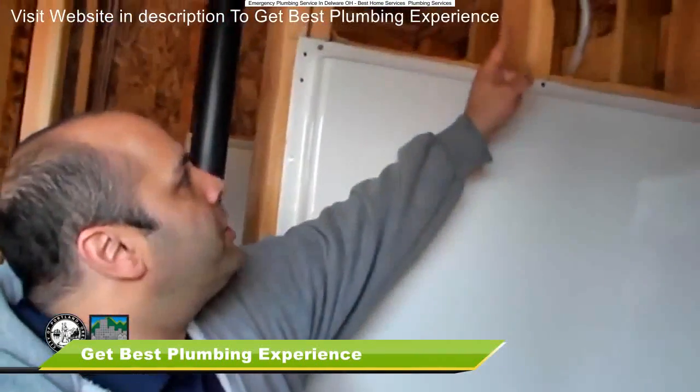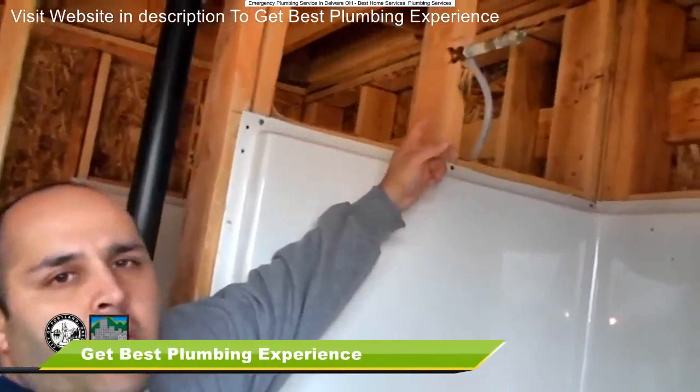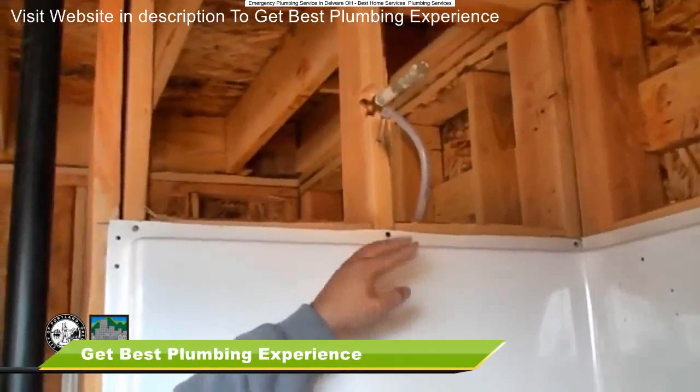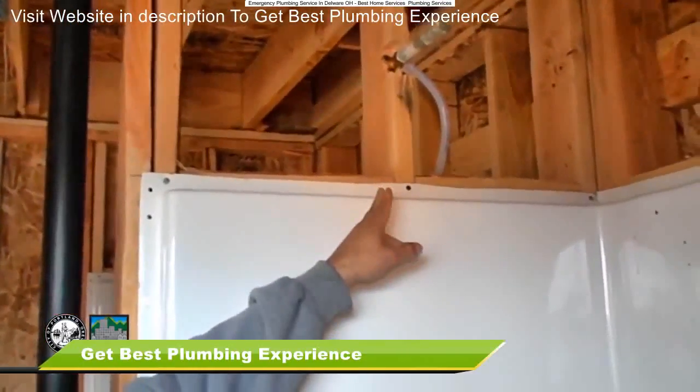So here you can see our shower head is secured into the framing so that when you hang something on it or pull on it, it's not going to come out of the wall. So we secure it to the structure of the residence, not to the fiberglass itself. So you can make that as high as you need to make that work.